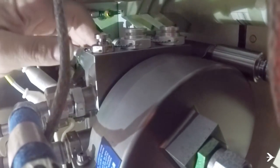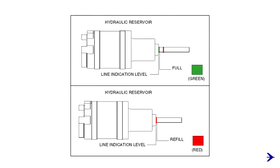Open the hydraulic system fluid level indicator access door and the hydraulic accumulator dump valve access door. Dump the hydraulic accumulator by pressing the dump valve on the hydraulic power pack and make sure that the two differential pressure indicators are not extended. On the hydraulic fluid level indicator, make sure that the indication is between the red and green lines.